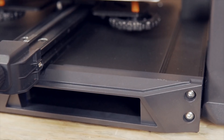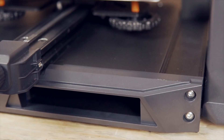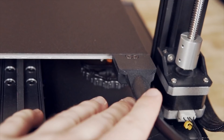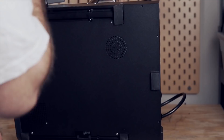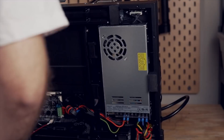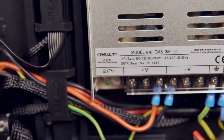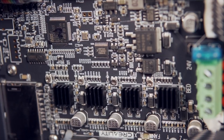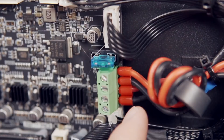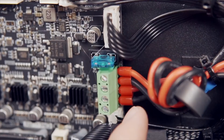There's a storage drawer in the front right of the printer for spare nozzles or tools. They definitely beefed up the strain relief on the bed for the Ender 3 S1, and the cable management for the X-carriage is also much cleaner. The Ender 3 S1 is a 24-volt system running Marlin, and they relocated the power supply from the back right side of the Z-axis to the underside to make way for the second Z-motor and lead screw. I cracked open the bottom and found a 350-watt Creality-branded power supply and a new controller called the CR-FDM V24-S1-301. Cable management was quite nice, ferrule connectors were used, and there is a fan in the case to help with heat.